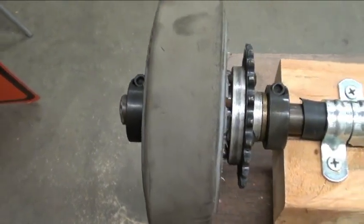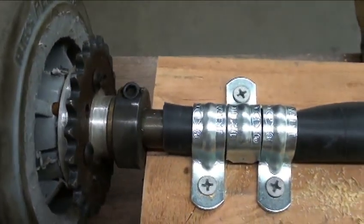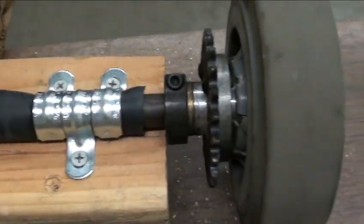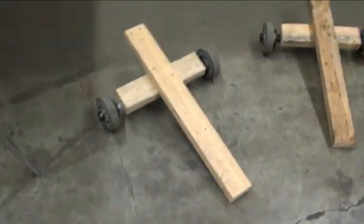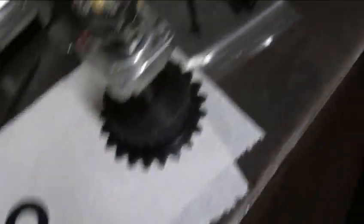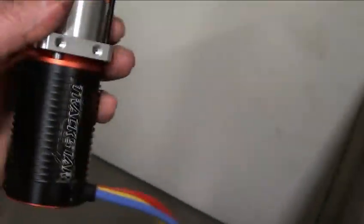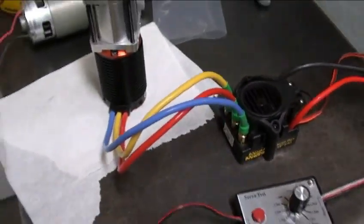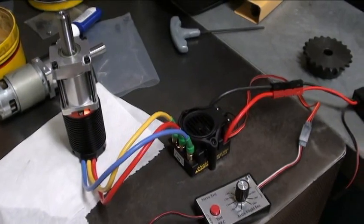Split collar, Coulson custom hub, plate sprocket with bronze oil-lite bushing, another split sprocket — you can see the axle and the impromptu shock mount. Then a repeat on the other side. I have a pair of dueling crosses. I suppose more lube is better than less lube. One completed — Banebots P60 with Trackstar motor. It does the 6S beepy thing, plays the music, and we're ready to go.